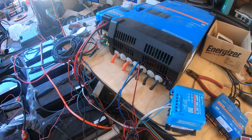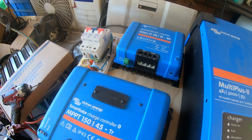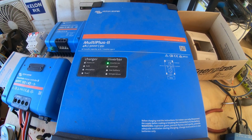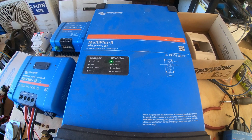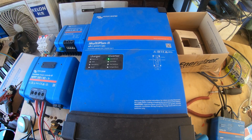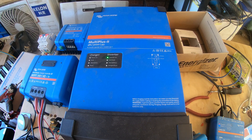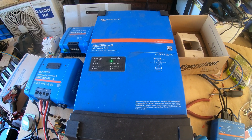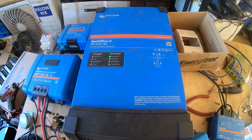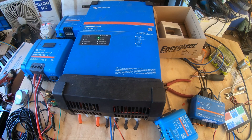It's outside — not in the caravan yet. There's a shunt attached to one of the Victron battery meters. We've got an isolator for the AC loads and AC input, and we're in inverter mode at the moment. This has the ESS — Energy Storage Assistant — loaded in it, so it's actually more of a house configuration. For the caravan you don't really need the ESS assistant. For anyone not familiar with Victron, you can get assistants for the inverters to help with AC coupling — a non-islanding PV inverter can work with the loads on the Multi Plus, effectively becoming an islanding inverter. But for the caravan we just need the DC input when not on a generator, and when we are on a generator we want the charger to work at maximum performance.